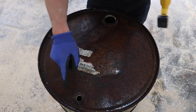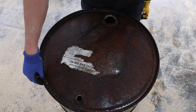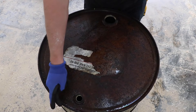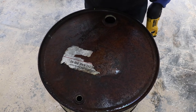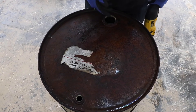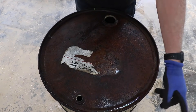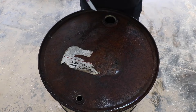We're going to cut the top out. You could use an angle grinder and cut below the rim on the barrel, but the problem is this rolled-over edge is where all your strength is on the top. If you cut on the inside, it gives you a guide to easily cut it out, and you maintain the rolled edge — it gives that circle more structure. That way, as you burn and the metal degrades, it doesn't deform easily and holds together better. These things don't last forever — they're disposable — but you should be able to get two, three, four or so years out of one. We're going to cut the top out, then use the unibit to drill some holes along the sides down low as well as in the bottom. That's pretty much it — let's get to slicing.